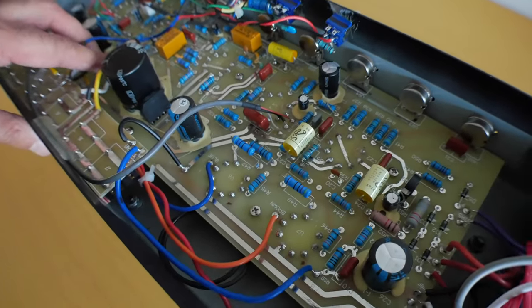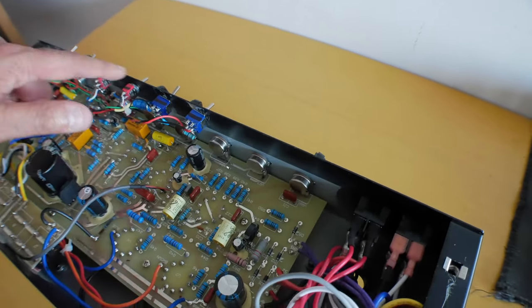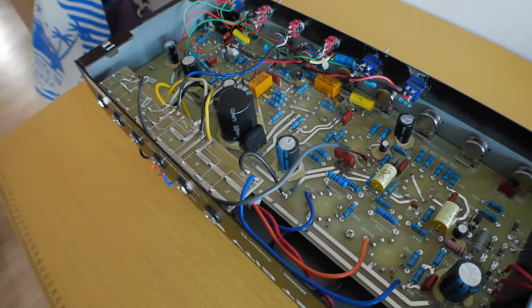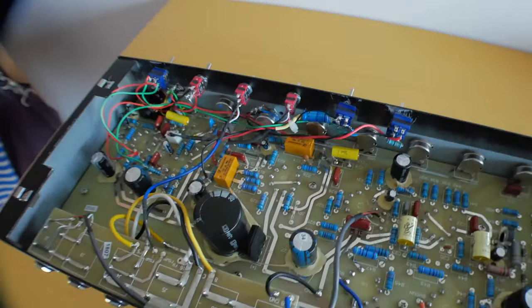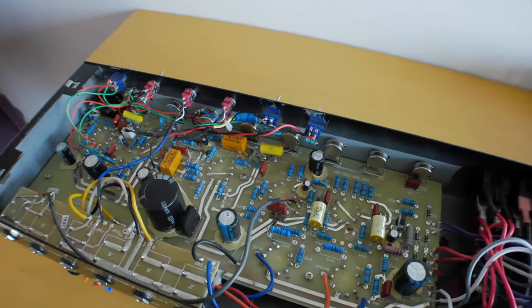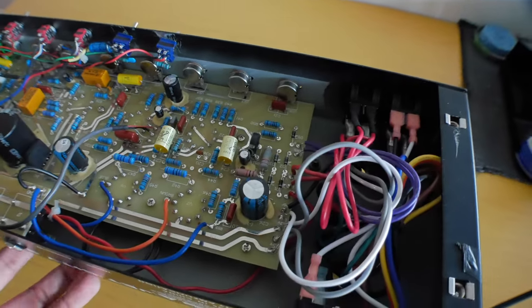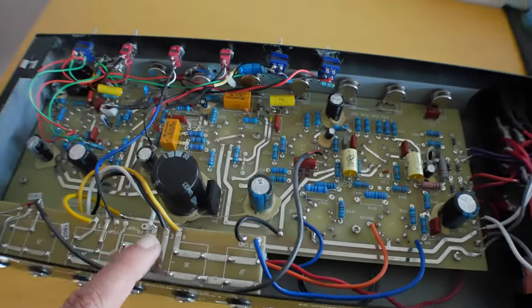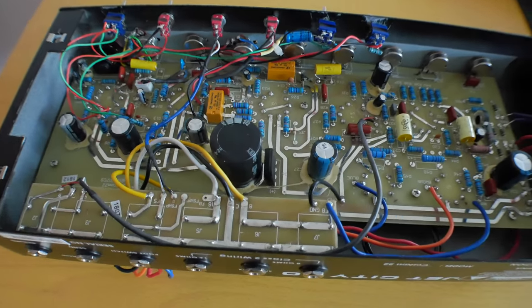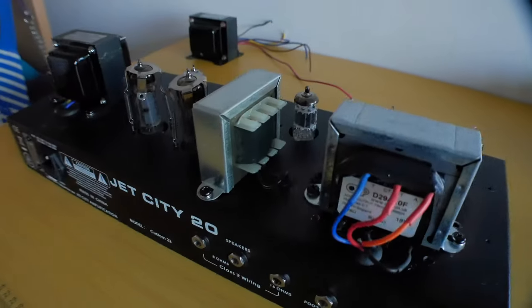And I did all of this off camera because I needed to take the board completely out, which meant taking all of the pots off, all of the switches off, taking this out as well. Relatively long process, but not a difficult process. And then just re-drilling holes because the old transformer had four screws. The new transformer just has two screws, and also installing the choke as well, which is around there underneath the board. And the output transformer is somewhere around here as well. So nice, neat job there. So I'm going to get this in the studio and play some more clips.